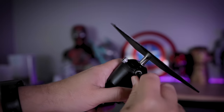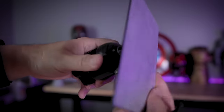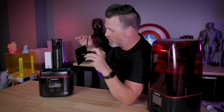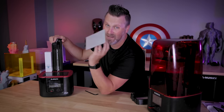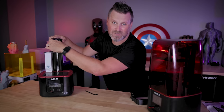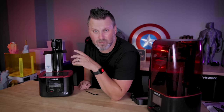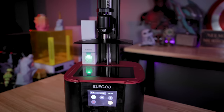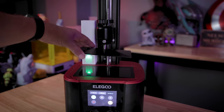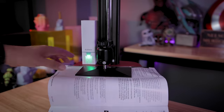The process usually starts with taking your build plate and making sure the bolts are nice and loose, and that your build plate is clean of any materials or debris before attempting to level it. You can then remove the vat if it's in place, attach your loosened build plate to the printer and secure it. From here, you typically grab a piece of paper and begin the leveling process by going through the menu system and selecting the homing function to home the build plate down to its lowest position against the paper or cardstock.